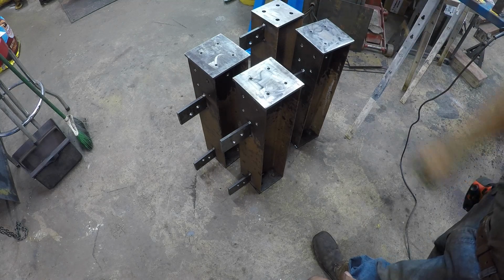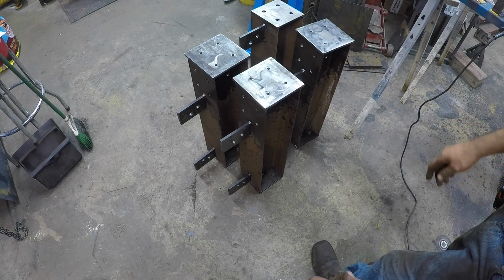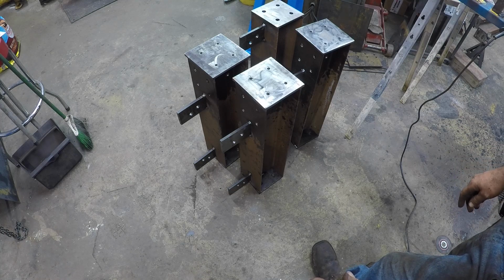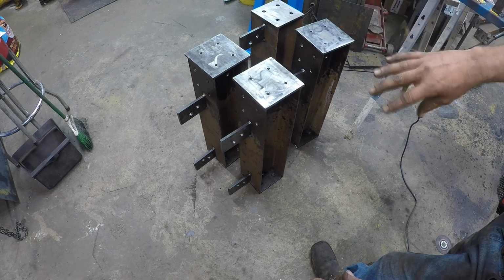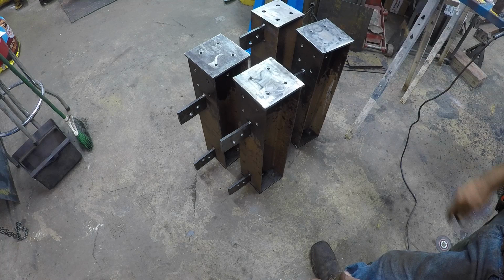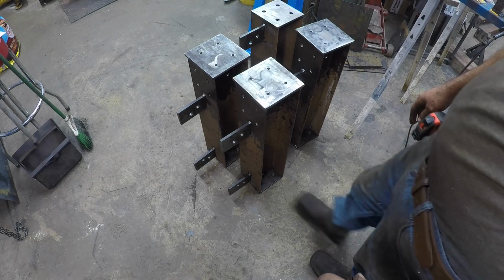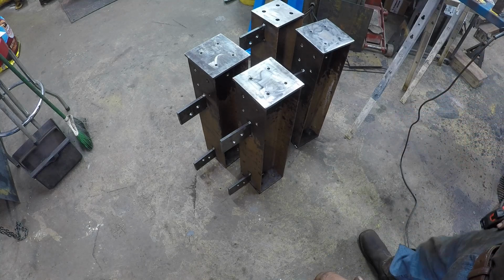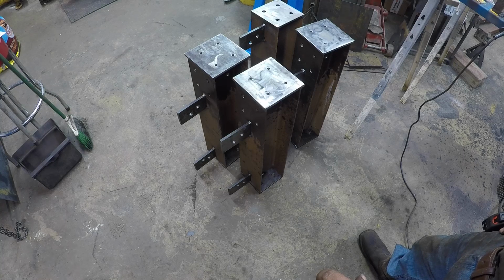That one's upside down, in case you're wondering. I'll clean up in here a little bit and get that plate in here. And then I'll pick a side that I want for the top. Make sure that's down. I like to get this all bolted together on the plate and square it up with the plate, and I can center punch all the holes that are going to be drilled and tapped in the plate. Now I got 5/8 bolts that are going to go up through that.